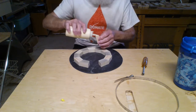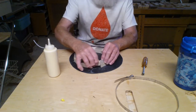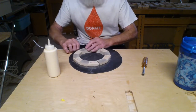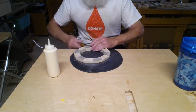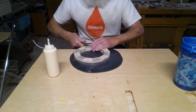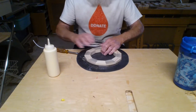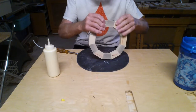This is my last one — I do both sides. I do a little rub on one side so it doesn't drip down too much, rub on the other, then grab my band clamp or hose clamp. I give it a little snug up by hand and then tighten it up. I don't tighten it all the way yet — just snug enough so I can handle it. I want to make sure all my points on the outer end are connected, and I'm going to center my hose clamp on my wood.